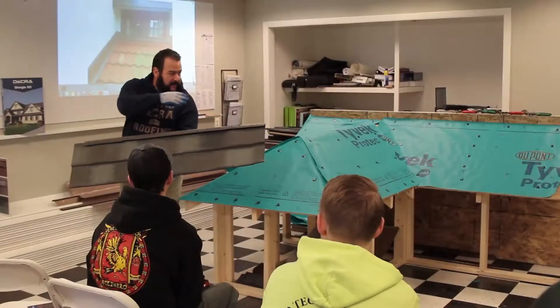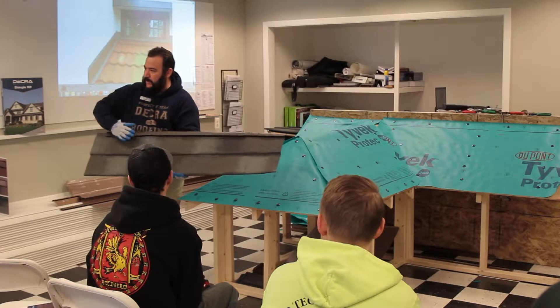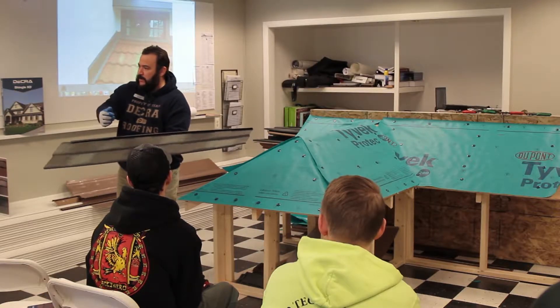So if we had a big stretch of roof to do, what I normally do is just take three or four panels, randomly shuffle them and offset them with each other, and run one saw cut. Don't even get out a tape measure, just run a saw cut right through them all. Boom — you've instantly got three or four starter pieces to work with.